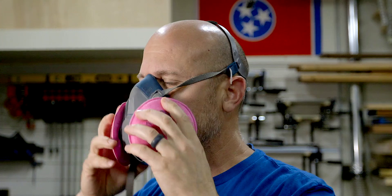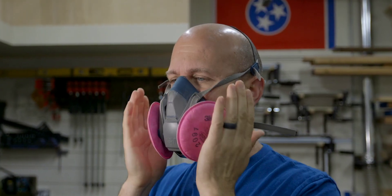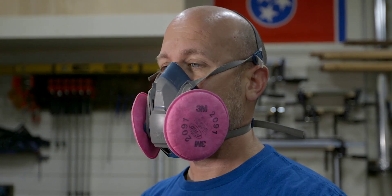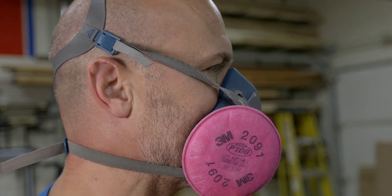So let's talk about how to protect your lungs by talking about how masks actually work. First up, we have a negative pressure mask. This is the type of mask most people think about when they hear the term dust mask, like a P100 or an N95. They work by creating a seal around your face. When you inhale, you're actually pulling air through the filters yourself — your lungs are doing the work, which is why they're called a negative pressure.